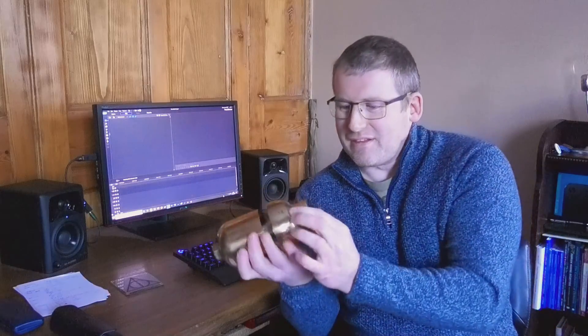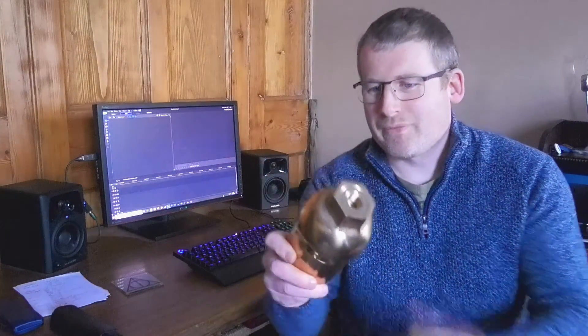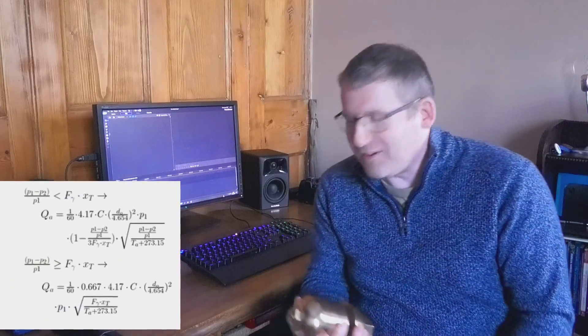So I thought I'd calculate this back and just see what sort of pressure we're going to get, because with a locomotive you've got anything between 140 and 250 PSI to blow this whistle, going through a half inch hole. So I did a few calculations out of my engineer's book. My compressor at work gives out about 56 CFM and powers everything we need. It seems that 140 PSI through a half inch hole gives you about 408 CFM, and 250 PSI - on a much bigger boiler like Tornado - gives you about 728 CFM through a half inch hole.